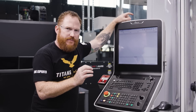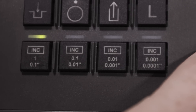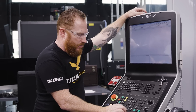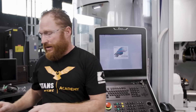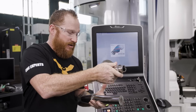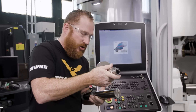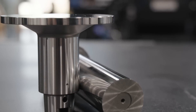If you need a smaller specific increment — say you're touching off or recalibrating the machine — you can utilize the various increments. We have a hundred thou increment, a ten thou increment, a one thou increment, and a one tenth increment. With a one tenth increment, each push of a button would move that axis by one tenth. A reason you'd want to use a small increment one button at a time is if you're calibrating the machine. We have calibration equipment that goes into your workhead and into the spindle — those have to come together and actually touch. So to do that safely, you'd use that one tenth increment button to ensure that we don't crash those two parts. I will show you in a different video how to properly use this equipment to calibrate this machine.